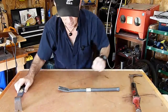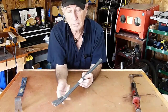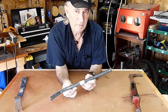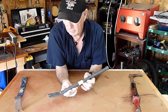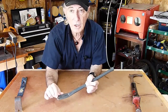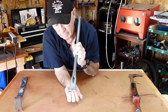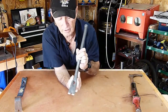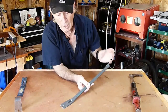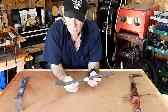This one here I bought last year for a big job. I had to pull 3.5 inch ring shank nails from an old deck and flip all the boards to renew the deck. I discovered this one at one of these tractor supply type places, and it was only like $7. I thought this can't possibly work. About 3,000 nails later, I said this is a pretty impressive little tool. I did take it to the grinder and redo the edge a little bit. With pressure treated lumber, you drive these in front of the nail until you get the V up underneath the head. The easiest and safest method was to leave it like that and just jump on it with your foot. I'd rather break the tool than get hurt flying around.